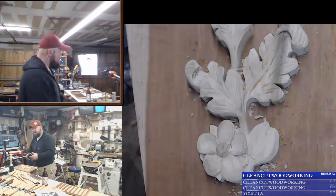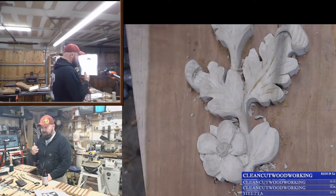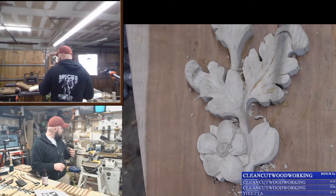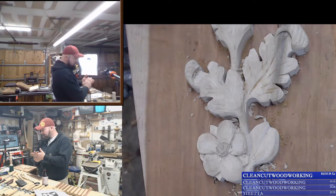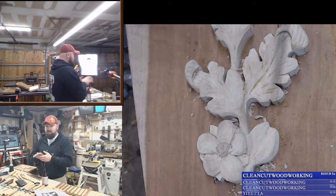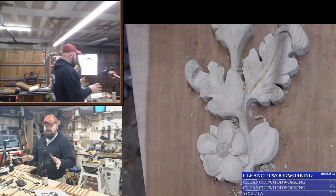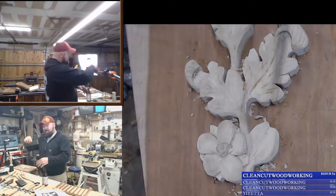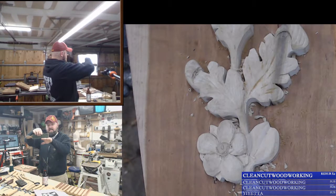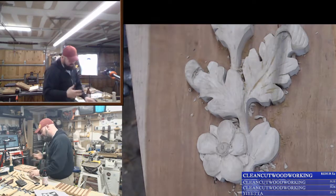Oh, batteries are out. Sorry. They work really well for sharpening my scrapers for turning. I just have that one on the 1.5-inch strip, set at about 80 degrees, and I just work it back and forth. It only takes about 2 swipes, and you got it perfect. If you don't touch it and you go back, you always get the same exact cut. I do that if I need to square them. I have the bed, the deck, and then there's a wheel, and I just touch it, and when I square the blade off, it gets out. Sometimes they get out.